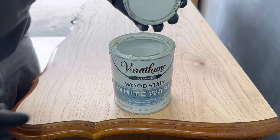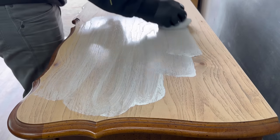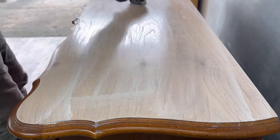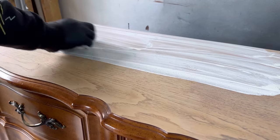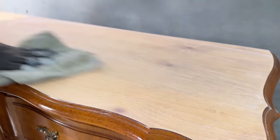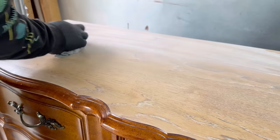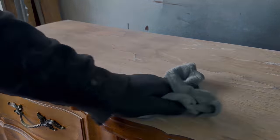With these French Provincial sets I like to do bare wood on top, but the wood in its natural color has a little yellow tint, so I like to use this Varathane white wash to cancel out some of that yellow tone and give it more of a natural white wash look. Don't let it sit too long because it will tend to stain the wood a lot whiter and it's hard to get off — apply it and wipe it straight off. If it's not as white as you want, you can always add more.